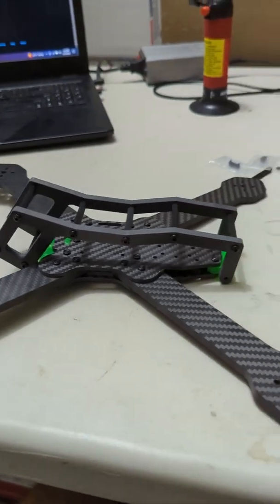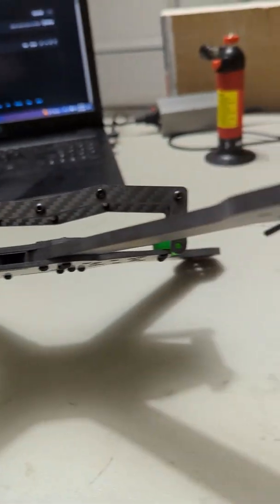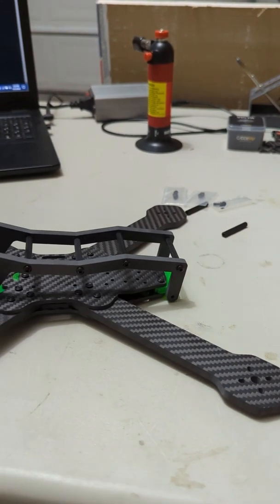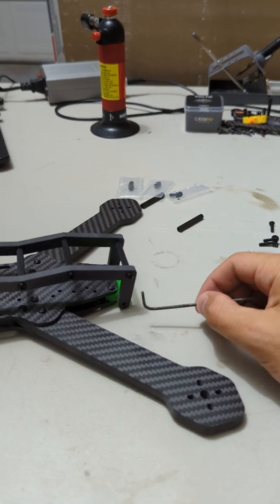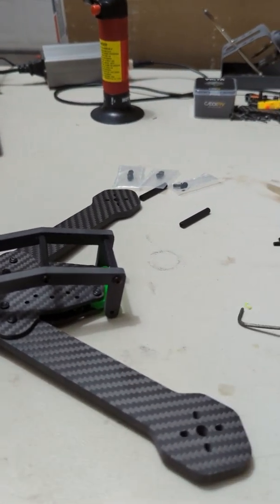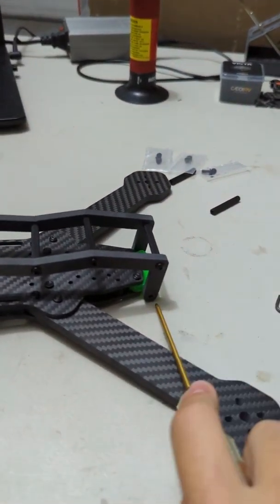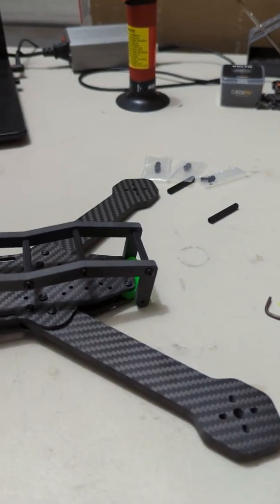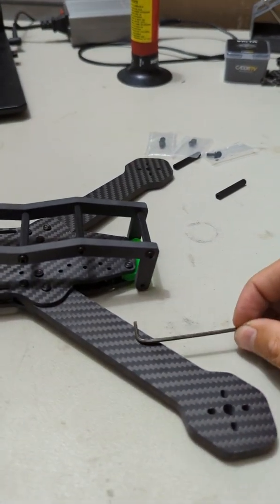This is what the canopy looks like installed with no prints. You would add an additional bolt in the bottom and on the rear link for your hinges. One last thing I would recommend is having a 2mm traditional hex key for taking this bolt out, because the arm is a little bit in the way. If you use a hex driver it's a little difficult to get in there, so I just keep one of these in my tool kit and it makes removing this bolt really easy.